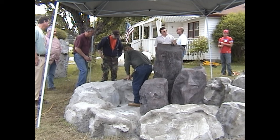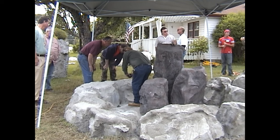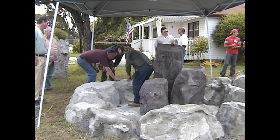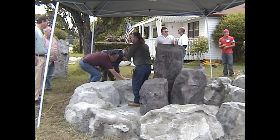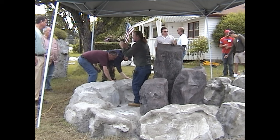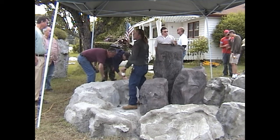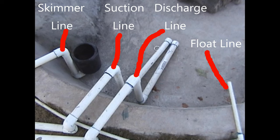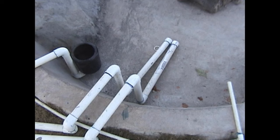All the rocks were complete, with the one exception of the removable rocks that would cover the plumbing that we would still need to install. The plumbing that we're installing is actually behind these bubbler rocks on the bond beam. In this clip, we have laid the plumbing out for where the skimmer canister will be placed, and we have also placed the suction line for the pump, the discharge line for the pump, and the water supply line for the autofill water leveler float valve.